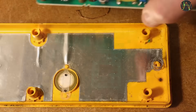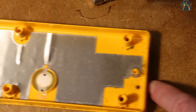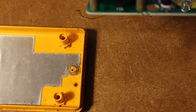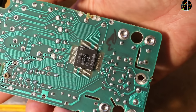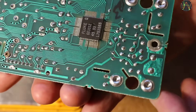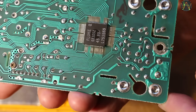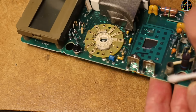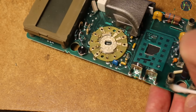The PCB is held with just one screw. There is a burn mark in the rear panel right under one of the 15A fuse terminals, but the PCB itself looks actually pretty good — nothing obvious. The date code on the Fluke chip seems to point to 1989, making this meter around 36 years old.